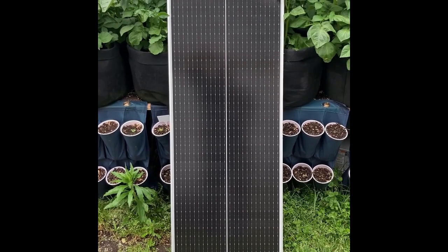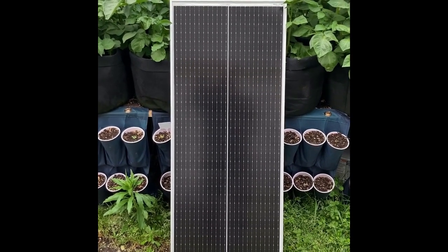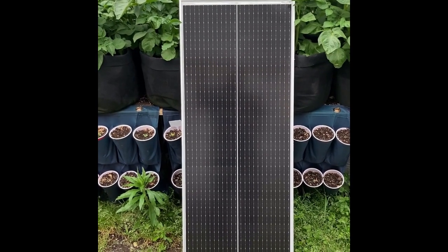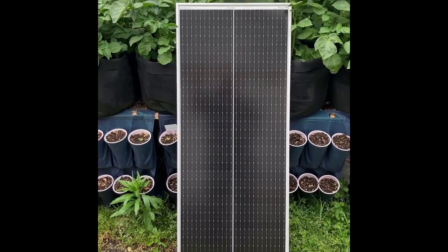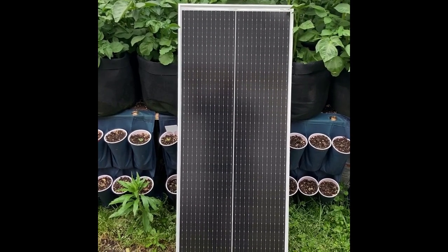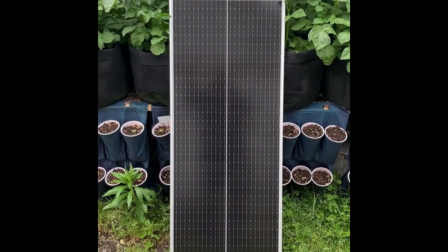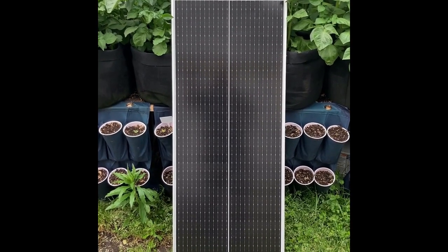Being a 100 watt panel in full sun, it's going to give you tons of power. If you look at that $12 super battery we just talked about, this can charge that at full power, even when it's pretty cloudy outside — still charging at 20 watts, 19 watts, even when it's cloudy. And even when it's really dark, like hurricane dark with black clouds and rain, you're still going to get about one watt an hour. That doesn't sound like much, but I've got devices that can watch videos for one watt an hour, light for a quarter watt an hour, and play radios for a quarter watt an hour. Over the course of a 12 hour day, you might get 12 watts even on the worst solar day ever, completely raining outside. So a 100 watt panel is a great way to go.